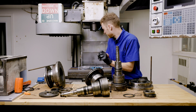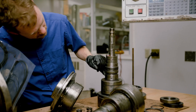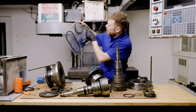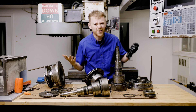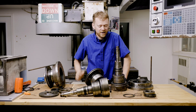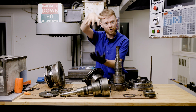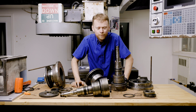So let's take these off and we'll look. One more o-ring sits around that guy right there. Three big quad rings, a bigger o-ring, a smaller o-ring, another one. Taking the turret apart is sketchy — disconnect the air once you unbolt this piston, because if you apply air, that piston and this whole thing will come flying out of the entire turret casting. I'd put some threaded rods on it, be careful, and pull it out. Don't try to pull the turret unless you have an overhead crane or an A-frame hoist. It's just so much easier and safer — dealing with a cherry picker or a forklift is a pain.